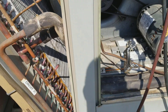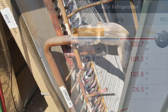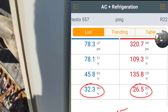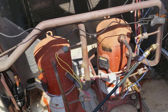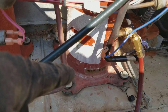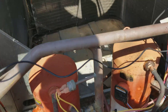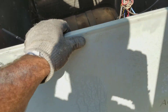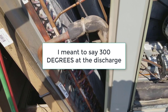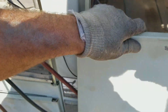I just changed out two plugged filter dryers in this unit, and lo and behold, circuit one got high subcooling, high superheat, and I just couldn't leave it like that. This compressor is probably already doomed — look at the color of the stickers on compressor one, and the paint's peeled off from high superheat, from high compression. I was probably running over 300 degrees discharge, so that compressor is probably doomed anyway. But I put new filter dryers in down there, and they are twice the size of the originals that superseded them.